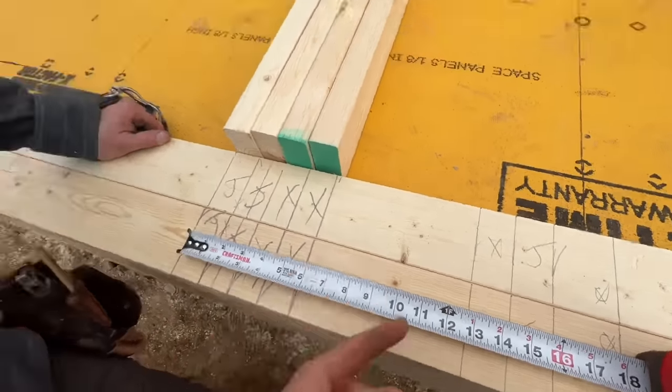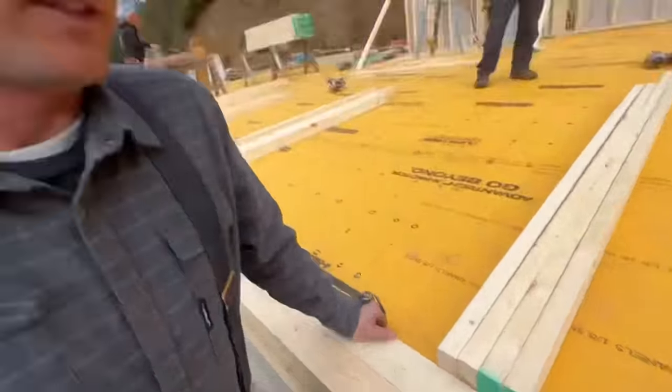That's how we determine how much space to leave. There's a deck out here, there's a door to the deck, there's a window on each side of the door, and there's going to be a light outside on the deck. Where's the switch for the deck light going to be? Right there. If you didn't leave room for that, it would be somewhere else not on your path out to the deck — so that'd be a problem.